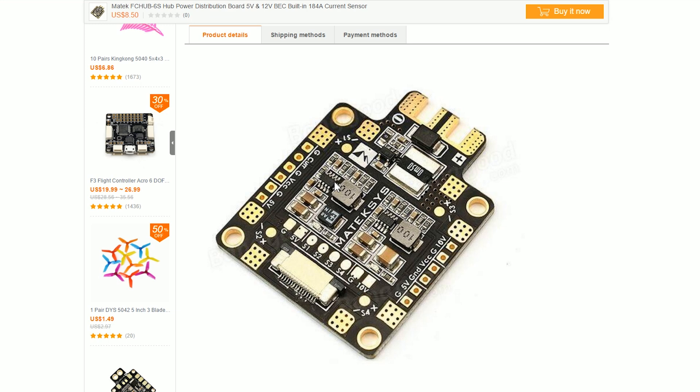So it's got a five volt switching regulator, and not a 12 volt but a 10 volt switching regulator — and this is a good thing. Most components we're going to use aren't running at 12 volts internally; they're probably running at something like five volts or 3.3 volts. For example, an FPV camera may accept up to 36 volts input, but internally it's stepping that down to 3.3 volts using a cheap linear regulator that's going to get super hot — and hotter the more volts it has to drop. By feeding a lower input voltage into your components, you're making their cheap inferior regulators work less hard, and most components will run just as well off 10 volts as 12 volts, just a little cooler and less stressed.